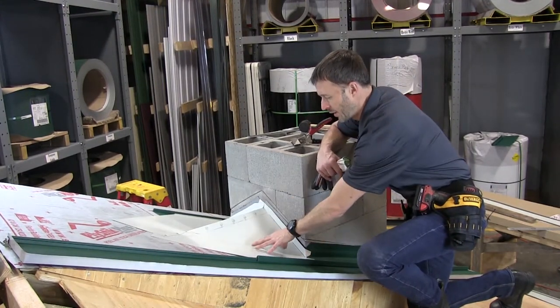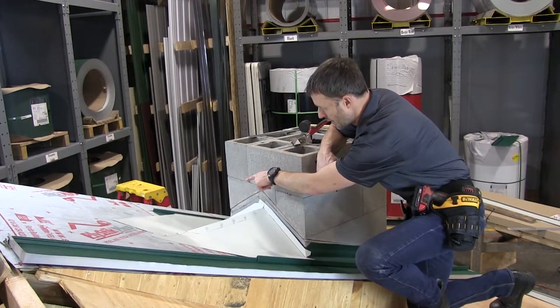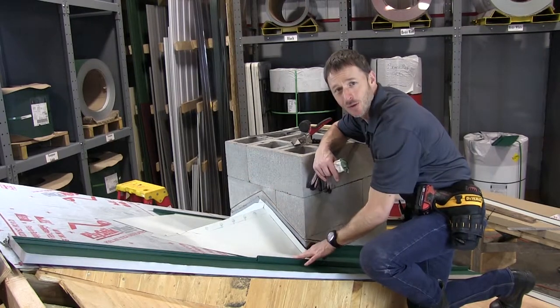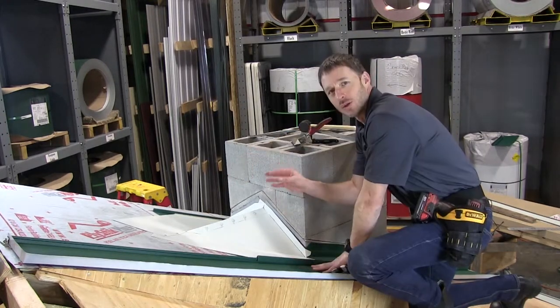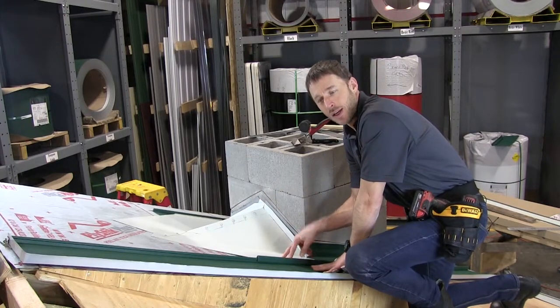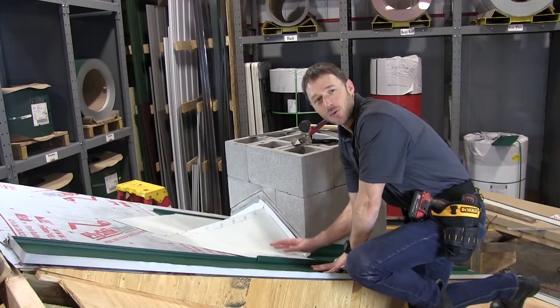We've made this pan for each side — it's the exact same — with the difference being that on the far side of the chimney where we have a male rib, we've cut it down to about an eighth of an inch as it walks up so that the next panel can actually clip in. The next step is to install a cleat in the valley and start running panels across the top and to the other side.